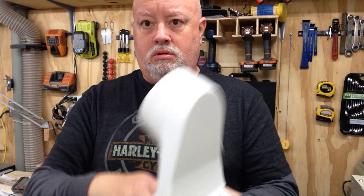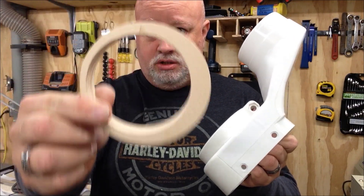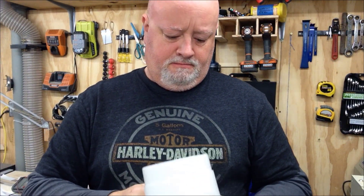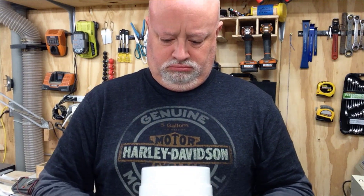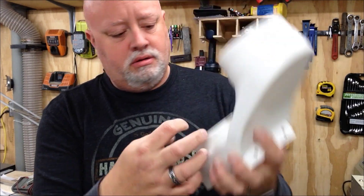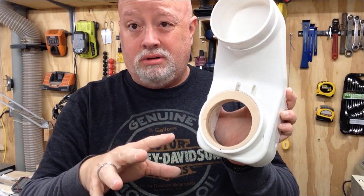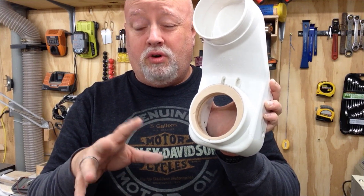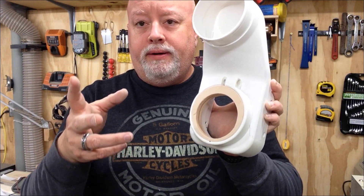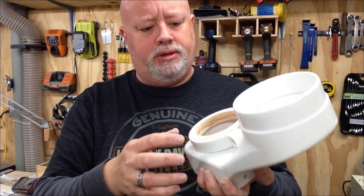My solution was to take this, throw it away, and make my own spindle adapter with an offset circle so it would fit in here and reduce that thickness. I'll put a link to the plans below — it's just the G-code, for Baltic birch plywood 18.4 millimeters thick. I'm using a quarter inch downcut spiral bit, running at 800 millimeters a minute at 20,000 RPM. Makes a little bit of noise, she screams a little bit, but that's okay.